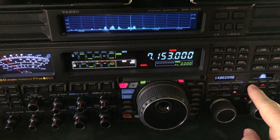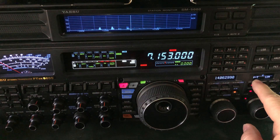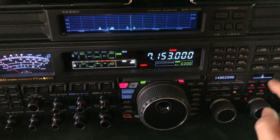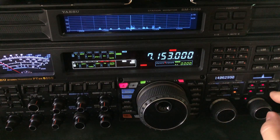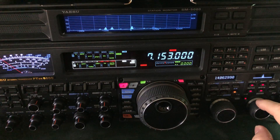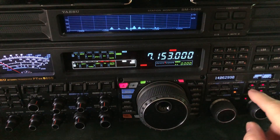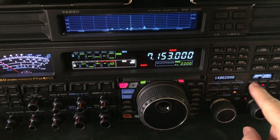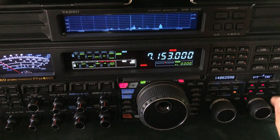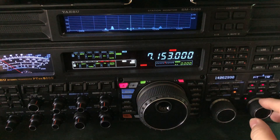This radio has the pre-selectors I mentioned in the previous video. This one has the external model called a Mu Tuner sitting over here behind my monitor. It's great to have both manual notch and auto notch. Auto notch is mainly going to stop somebody's tuning carrier, where manual notch can knock out these heterodynes.